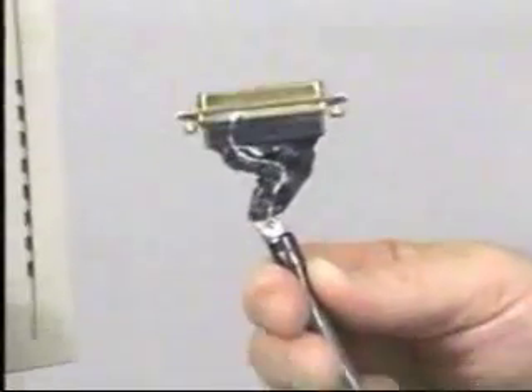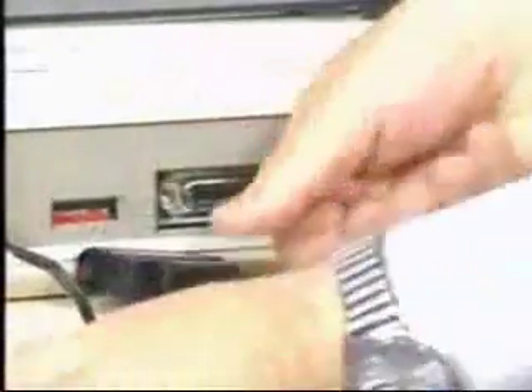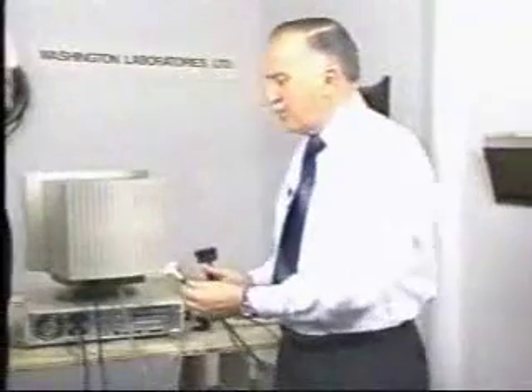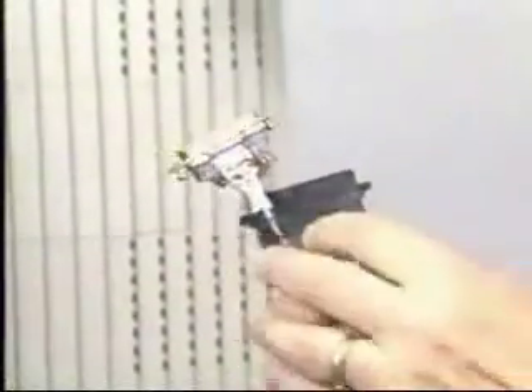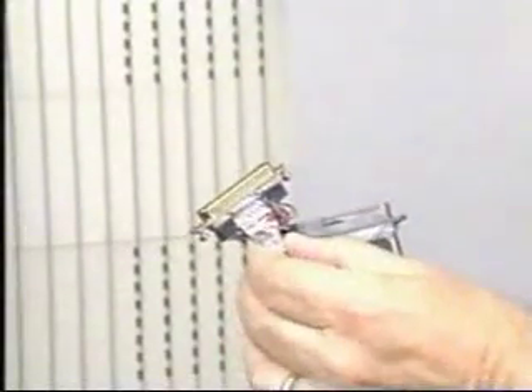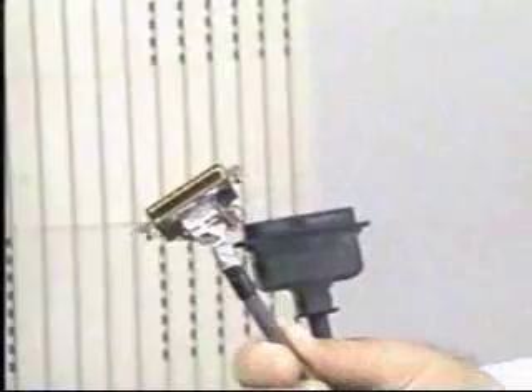For the sake of numbers, all you need is about 10 micro-amperes of current flowing on that shield to put you out of spec with the FCC limits. So how are we going to fix it? What we will show here is the removal of this particular cable, and then we will replace it with this modified cable. It is the same as the first one, except for this modification of the connector. The skinny wire that we had before is now replaced with a foil connected between the connector metal part and also the shield of the cable. That gives us a low impedance connection between the shield and the ground, which reduces the radio frequency voltage along the cable, and thereby the emissions go down, as you will note on the spectrum analyzer.